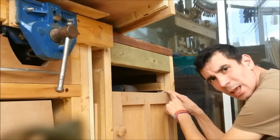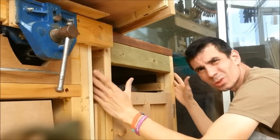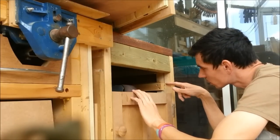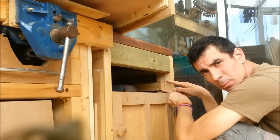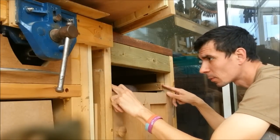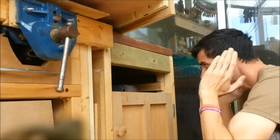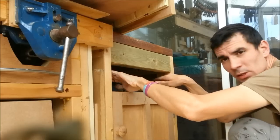What I've done here — because I've used table construction with proper legs and then clad it — is I've glued and screwed this piece of 2x1 pine. Hardwood is better, I have to say, but I've used softwood because that's what I had. I've just screwed it to the four legs so it runs flat and parallel, and the drawer just sits on top of this.